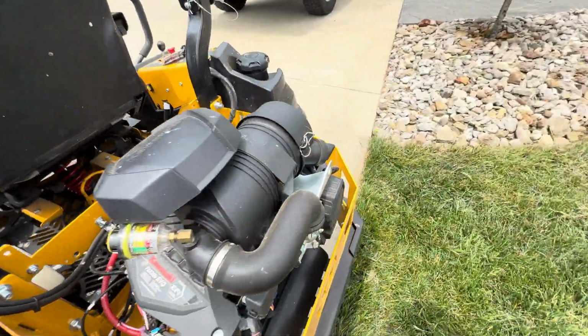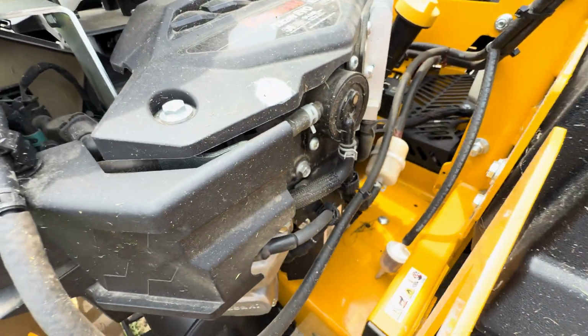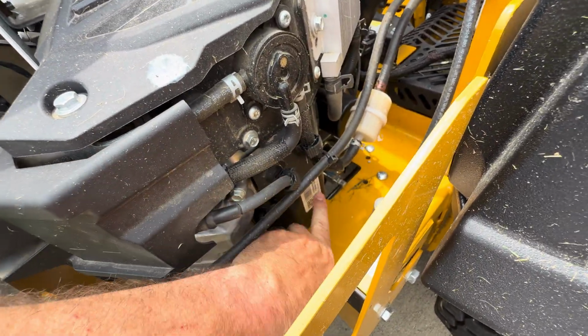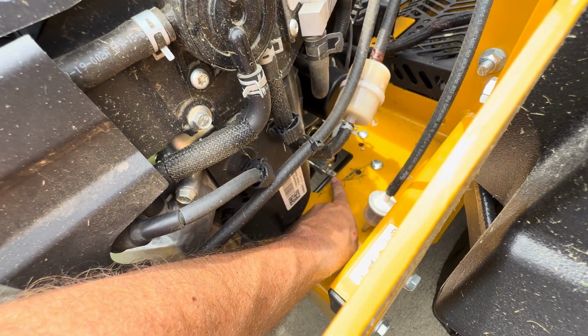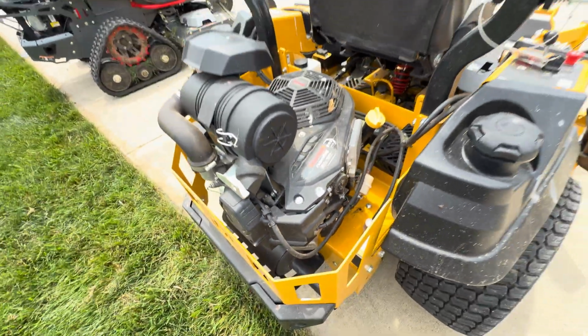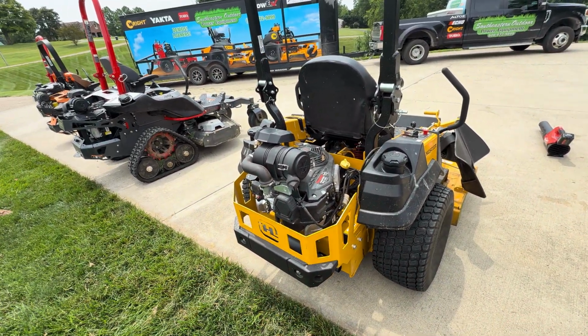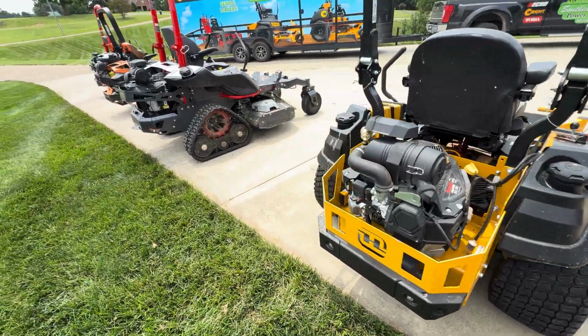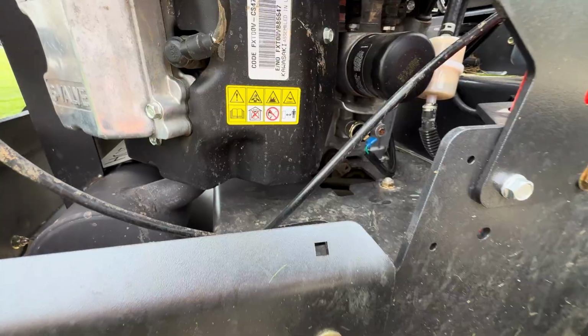As far as the maintenance on these, the Evo, to change the oil, it's right down there in that cover. So you take and loosen that bolt right there, and then it drips out of the front of here to change the oil in that. On your hydros, you're going to take a cartridge out, which all these are going to be the same because they run nearly the same hydraulic units. On this one, how do you change oil in it? Right here? Straight out the bottom.